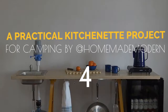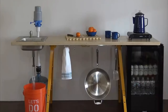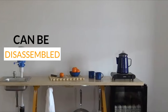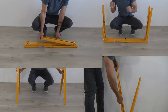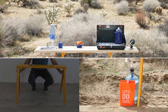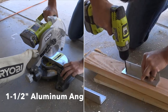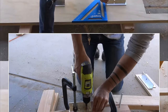Number 4: A Practical Kitchenette Project for Camping by Homemade Modern. This clever kitchenette lets you prep meals everywhere, inside and outside. The countertop can be disassembled from the legs, making it easy to transport. The folding metal sawhorse legs are foldable, adjustable in height, and have holes to hang kitchen items. With this leg shape, the kitchenette can stand firmly even on uneven ground. Aluminum angles serve as brackets to adjoin the countertop and legs from the underside — cut into pieces and drilled so bolts can be inserted, with matching holes drilled into the countertop and sawhorse.